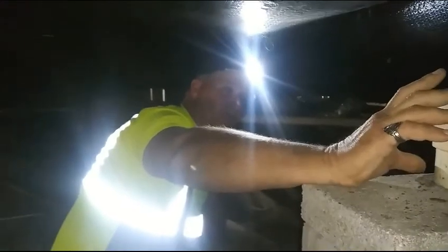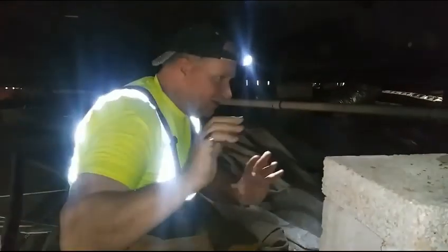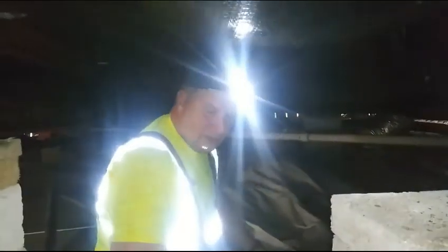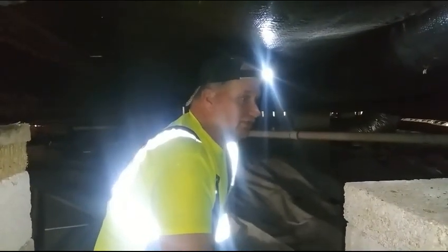Alright, we're under here. We set the water level up in the center of the house or somewhere close, so I can do 100 feet — 50 feet that way, 50 feet that way. What I'm going to do first is go through here and see where it is at level. Say it's like a cracker box on top of this — we're trying to figure out the angles, where I'm going to have to jack up. I might compromise and say let's go with where we're at right here because most of it's at height. That takes some experience to get good at. What we've done is set our water level to this frame, and I found out that side needs to go up about a quarter inch, so we're going to keep on going and determine what's going on.